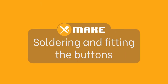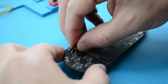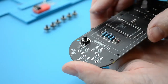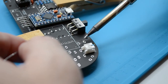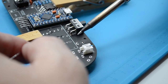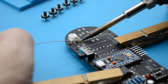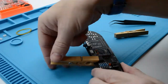Fitting and soldering the buttons. To solder the buttons, firstly solder the reset button — pick up the only button with an extruded tall shaft and place it in the reset button hole on the left side of the console. Firmly press down to push the button into position; do not push too hard as it could bend the button legs. It's important to solder the buttons flat, so check that your buttons are pressed up against the PCB. Press the button a couple of times to push it down. Once fitted securely, flip the PCB board over and solder the button in place. It's especially important to orientate the PCB for the best soldering angle, as this can be challenging as it is very close to the JST connector. If the button pins poke through too much, use your cutters to trim them shorter.